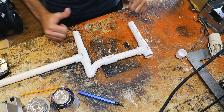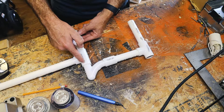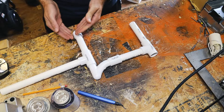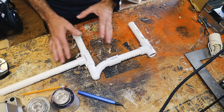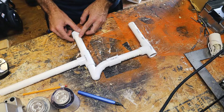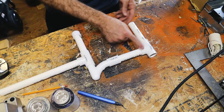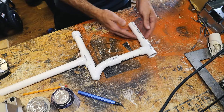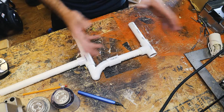This one will have a cap — and you have to cap this. You do not want the side before the P-trap to be vented. This needs to be capped. The reason we use a T here instead of just an elbow is so I can clean out the P-trap if needed. If debris gets in there I can pour bleach, vinegar, or whatever down there and clean it out by removing this cap. However, you do want the other side to be vented — just like the plumbing in your house. Everywhere you have a toilet, shower, or faucet, you have a vent going out through the roof. This allows the whole system to work and flow correctly with no gurgling.